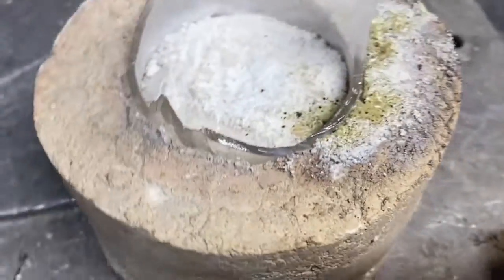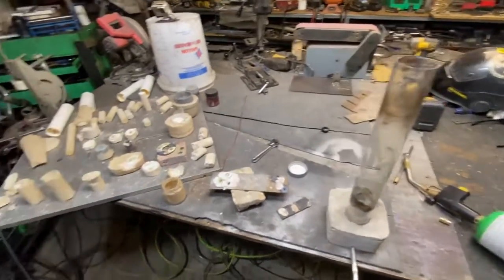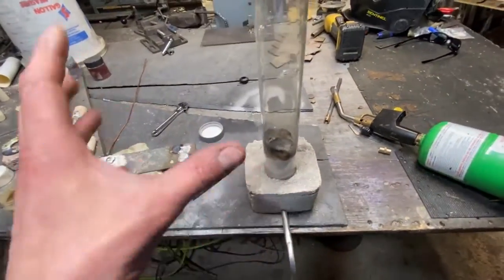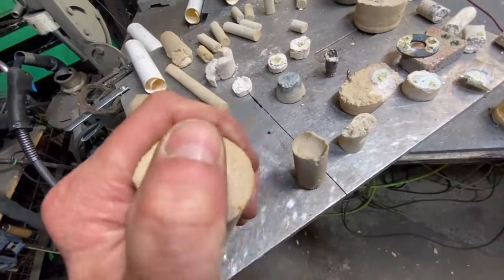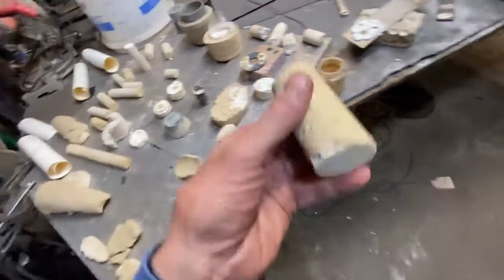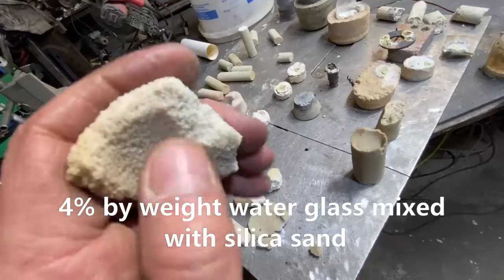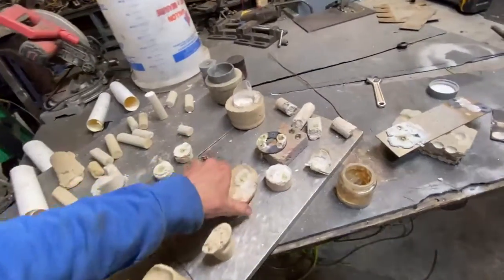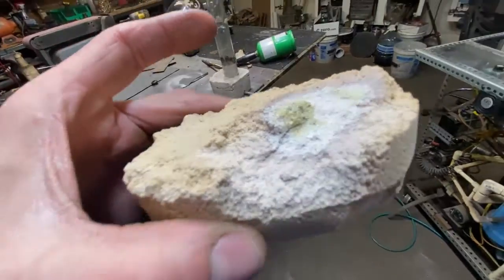Quartz is a beast — it's hard to melt quartz. I love how that didn't break — that's why this little apparatus survived its test. It had burning hot material in here. I mostly wanted to point out this refractory. These cores here are just not what they're cracked up to be — I thought they'd be stronger. They're not usable; I was going to make a crucible out of them. But this refractory glue stuff — it seems to be stiffer than the fire brick now that it's been heated.